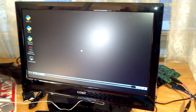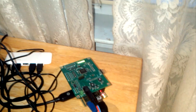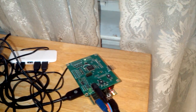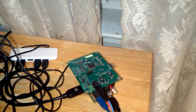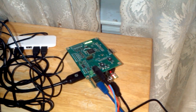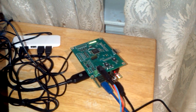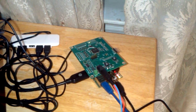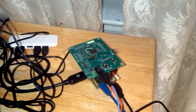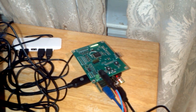Going over to the Raspberry Pi on the monitor — no communications. What it is doing is taking the 12-ish volts from the little battery pack there, converting it down to 5 volts to supply the Raspberry Pi, and then dropping to 3.3 volts for the PIC32 that's on there.